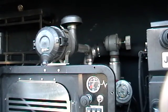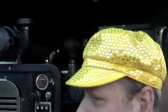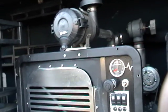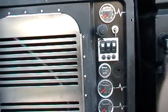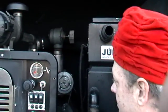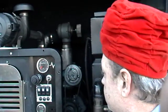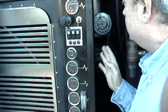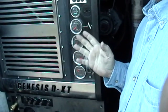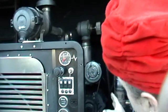So it was bypassing about 650 CFM. We've lowered the RPM to where the CFM is probably about 650 now, so it's just not going to relieve as much air, but the performance at the wand is going to be just the same. The reason that big blower was on there was not to have more vacuum to clean carpet — it was actually on there to load that engine to produce heat. Well, the machine is no longer heating with the engine, so we just don't need all that performance.